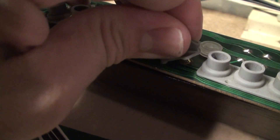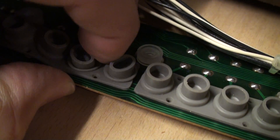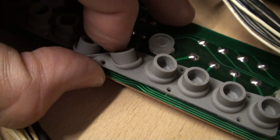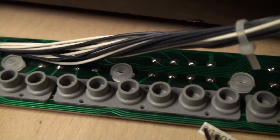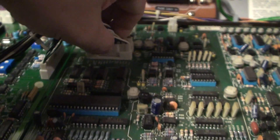You can see how easy these boards are to come out and go back in because the rubber is so soft on them. The little posts are easily pushed into the holes - not so with a Juno 106, where I'd need both hands and a pair of pliers or tweezers to pull the rubber posts through. The board that previously had problems in the bottom two octaves was using contact sticker adhesive discs rather than painting on the silver trace - let's see what happens now.